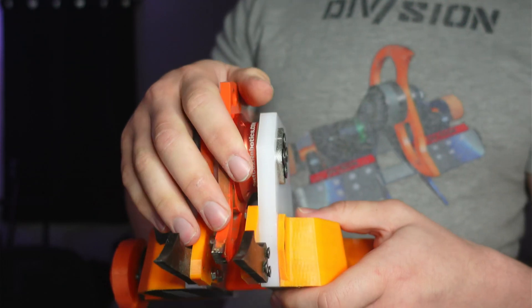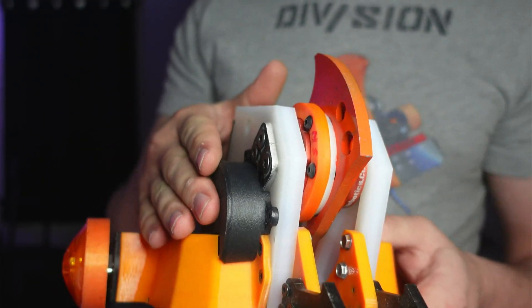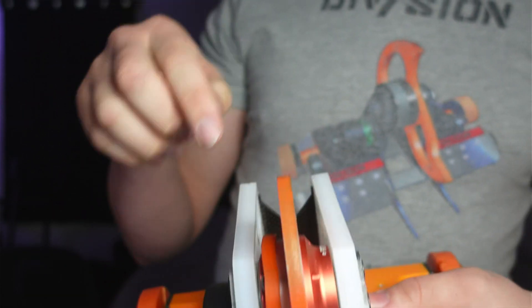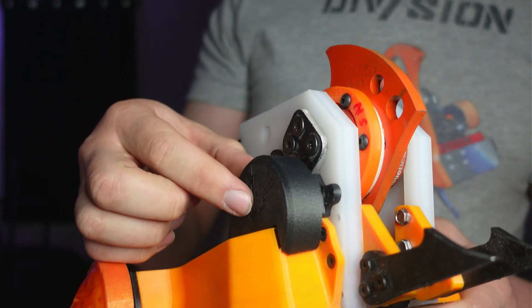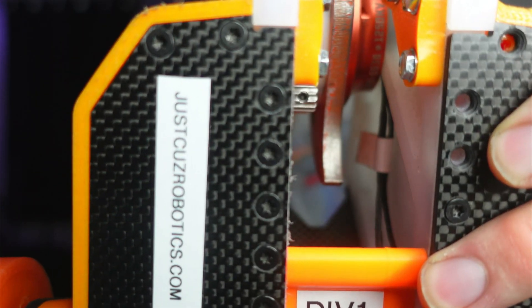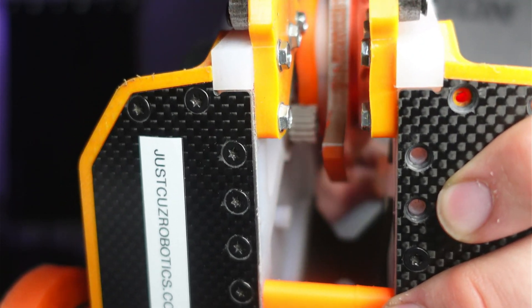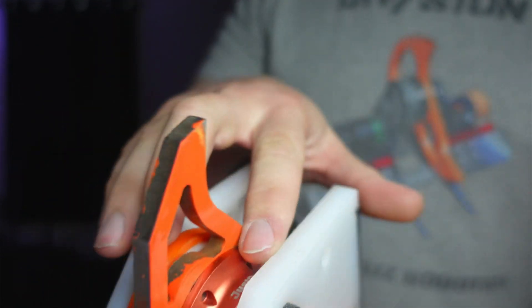The kinetic energy stored in the weapon is around 500 or 600 joules, but there's about three times as much just stored in the flywheel. PCBWay machined the flywheel shaft and the flywheel weighted disc itself out of 4140, and they also wire EDM cut the knurled wheel that drives the flywheel via friction drive system using a TPU 3D printed rubber disc mounted to this custom hub motor.